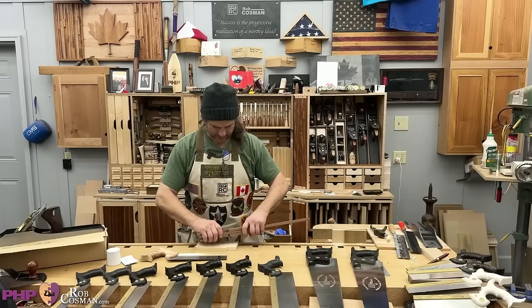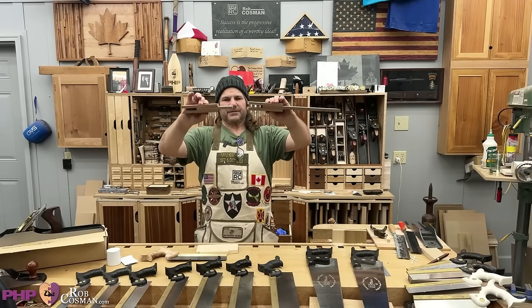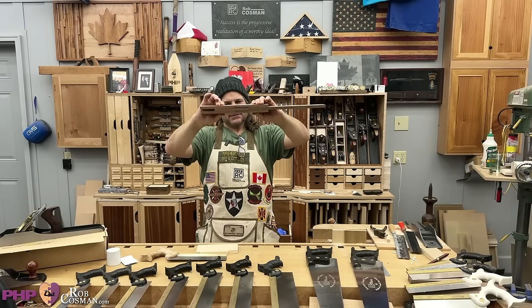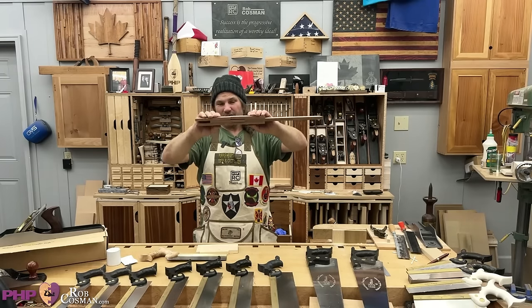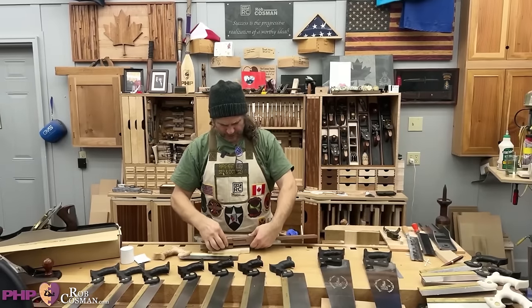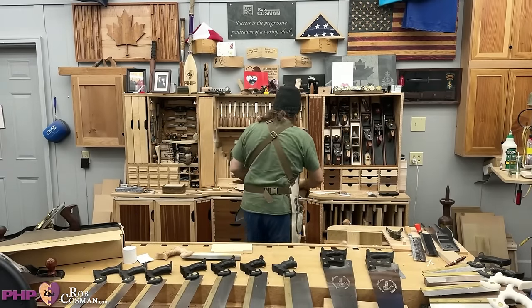He said it's 3 inches wide. Okay, if it's 3 inches wide, then I would probably do something like this. Three-quarter thick? Yeah, that only gives you a quarter. How could you divide that up? That might be enough. Yeah, again, it all depends on where the stress is, but I would probably join something like that. And not only could you glue it, but you could put a couple of dowels in there to pin it to help hold it.